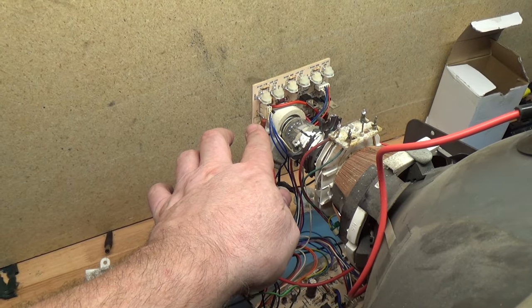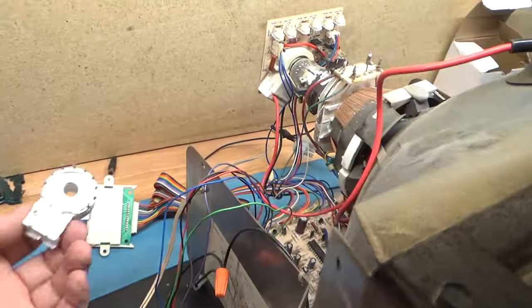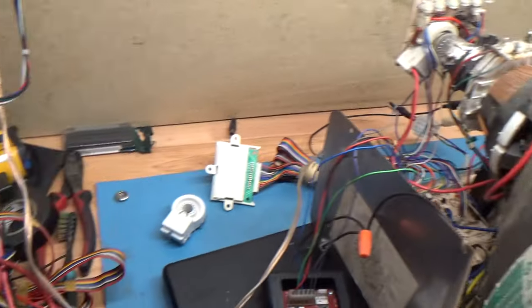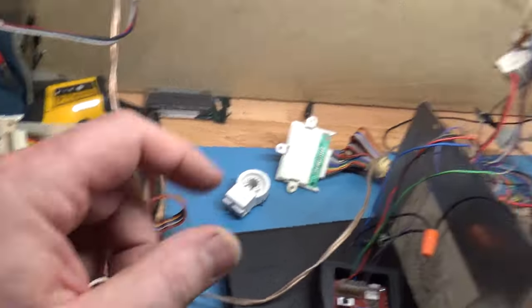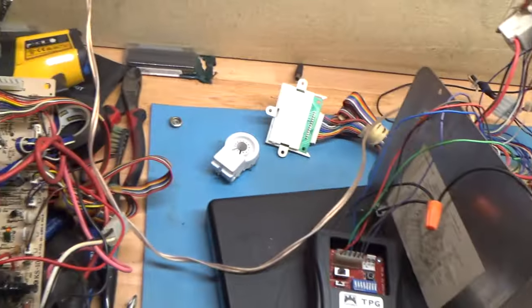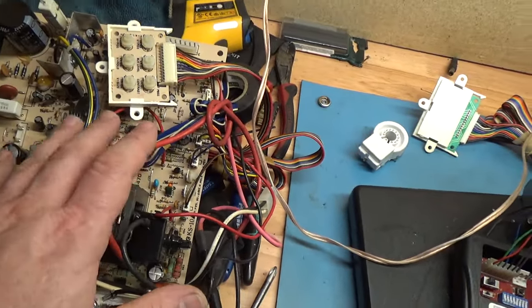I have to say this is now fixed and the only thing really wrong with it was the bad neck socket. I'll let this run for about half an hour to make sure it doesn't glow white hot. It's already operational. Now let's move on to the other chassis — the one that has no raster at all, no image at all, with the flyback cranked up and brightness, contrast, and color pots all maxed out. There's heater glow and high voltage but nothing on the screen. I think we'll switch to this one, knock out both of these in one video.